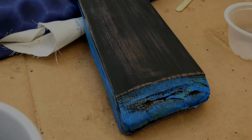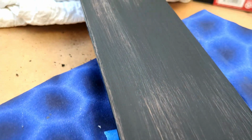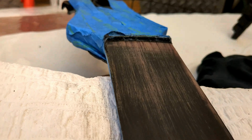Here the outcome of sanding of coat 1. You have to be relentless and unforgiving. Everything that is even a little bit bumpy has to go. The wood has come through in large areas, but there are more coats to come and cover it. Believe it or not, this looks actually pretty good for the first coat.